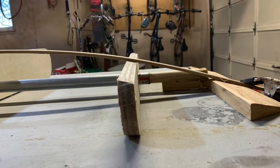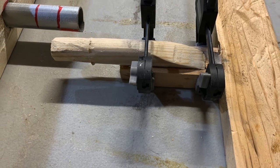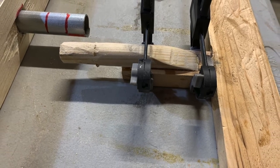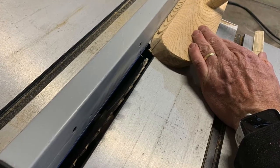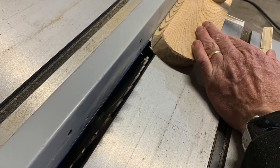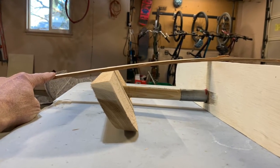In the end I had to do a little clever woodworking with some scrap wood to attach the nose piece to accommodate the angle of the taper at the front of the board. Bending a test strip over the front, I immediately found I needed to trim some wood back from the attachment. I cut 45-degree angles in the transom piece to accommodate the desired angle, then used another piece of test wood to confirm I had a good fit.